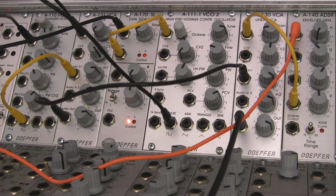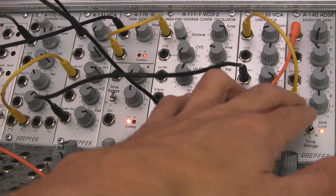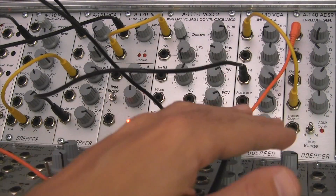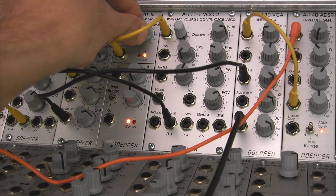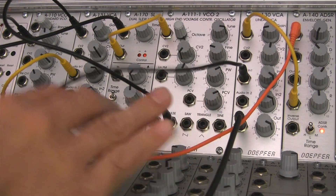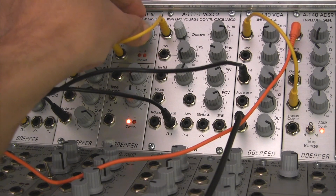So there we have our little timbre shift, or Glissando AM patch from the Doepfer manual. At this point there are a few different places you can tweak the patch. As we were doing a moment ago, you can go in and adjust the envelope generator to shape your sound. You can also adjust the slew amount — go up a little bit for a more pronounced effect, where the VCO takes a little bit longer to get up to the same pitch it's receiving from our sequencer, or bring the slew time down if you want a subtler effect.